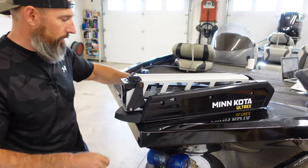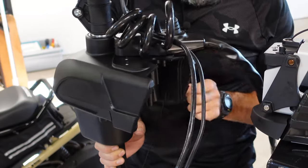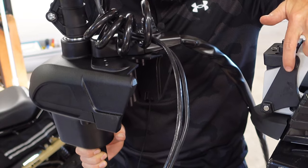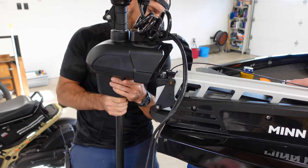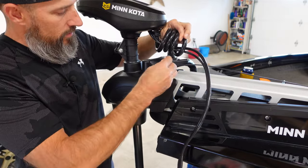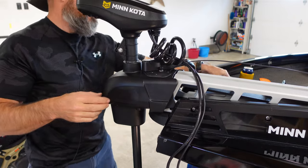I'm going to put the trolling motor up there — I've got my boy up here to help me hold this on the boat. It should slide right down over these little pieces — there's one here and one over there. If you look on the inside you'll see down at the bottom, that's gonna hook into the bottom one and the top one will slide in right here. Now I've got to put that allen bolt back in.